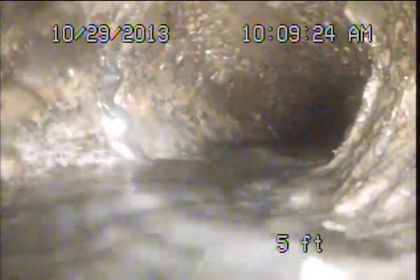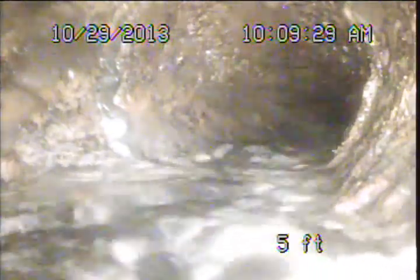Now the main sewer line through the front yard out to the sidewalk is a cast iron piping material. Now this does not appear to be the original pipe here on the property, and the way I'm determining that is at the connections, or the pipe sections where they connect to each other. You can see here that they have these rubber couplings. This is what they refer to as a no-hub connection. So it's a more modern pipe, sometime within the last 30 to 40 years perhaps.